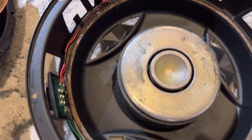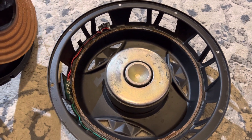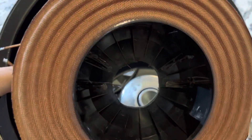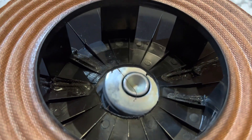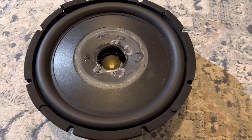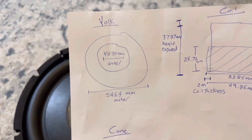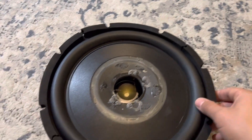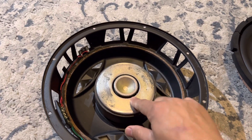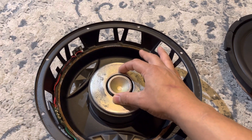Next, I'm ready to install the new voice coil - received one from Lower to Bass, with very equivalent parameters. In fact, it's actually going to be capable of handling a lot more power. The only prep work is to clean up the area where it's going to mount. One of the important things I stress in my other videos is to document all measurements during every step. I'm taking dimensions with my calipers of the yoke - this portion here is the motor, this is the back plate, this is the yoke, and that's the gap.